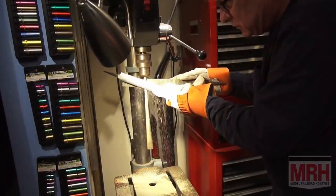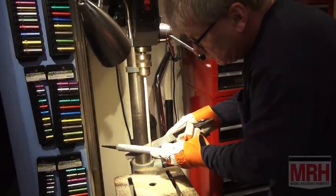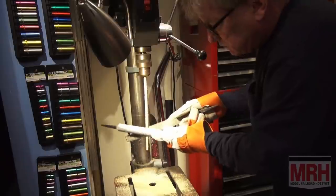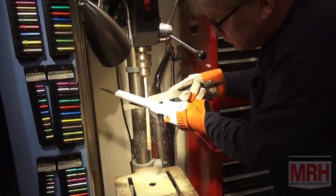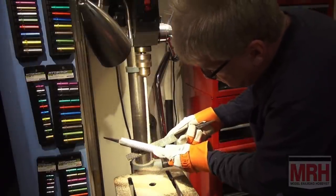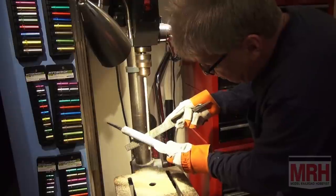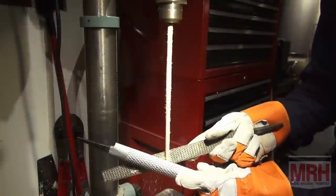The fastest and easiest way to taper our dowel rods is to chuck them into a drill press. You'll want to set your drill press speed to its highest setting, and in this case I've set it to 3000 RPMs. I also wear gloves, and I use 2 horse rasps at the same time to cut the dowel rod on either side at the same time down to a taper.